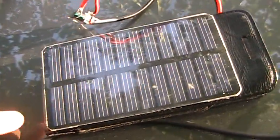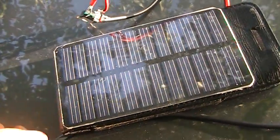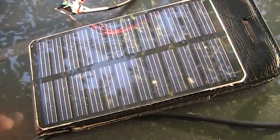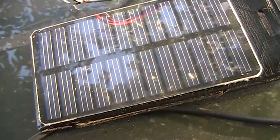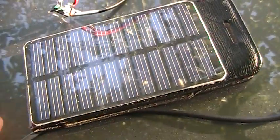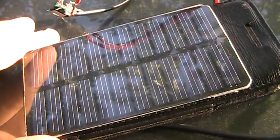Hello, I'm David and I'm going to show you a charger that I just made — one of my latest chargers. I started off with a solar panel. You can get these at hardware stores; I got mine at RadioShack. When you get one, try to get one over five volts and with at least half a watt of energy. Mine was six volts and one watt.